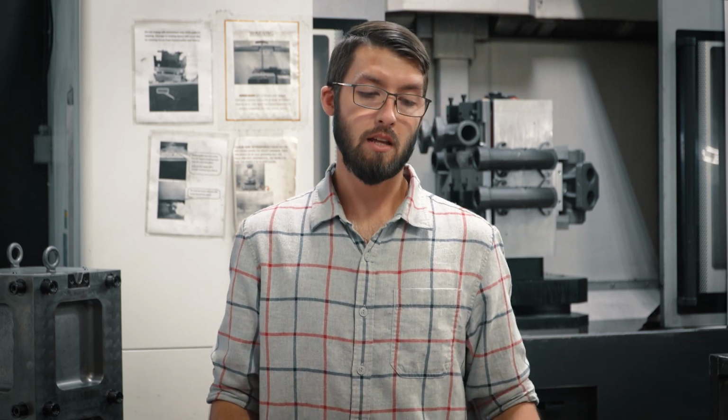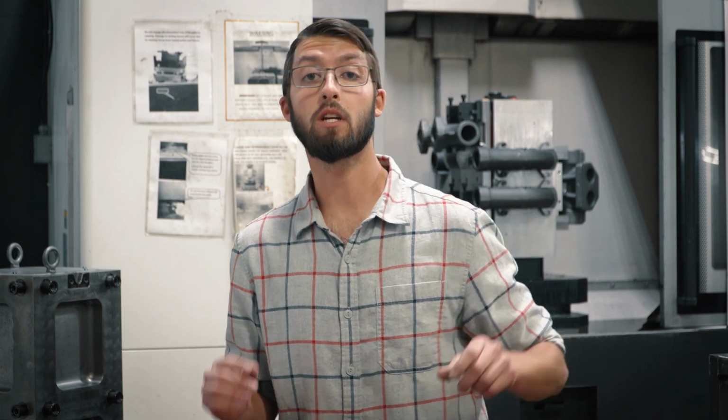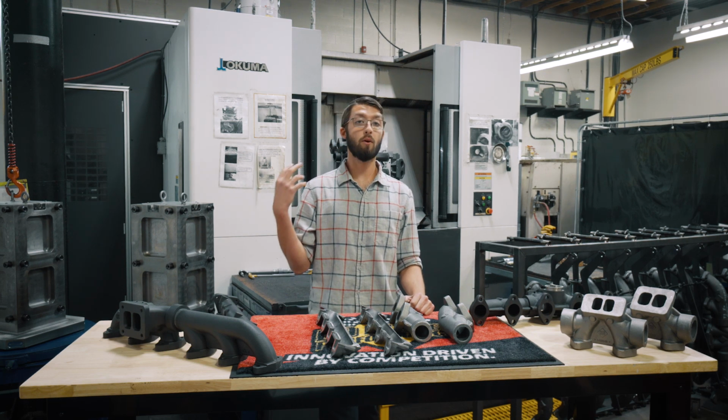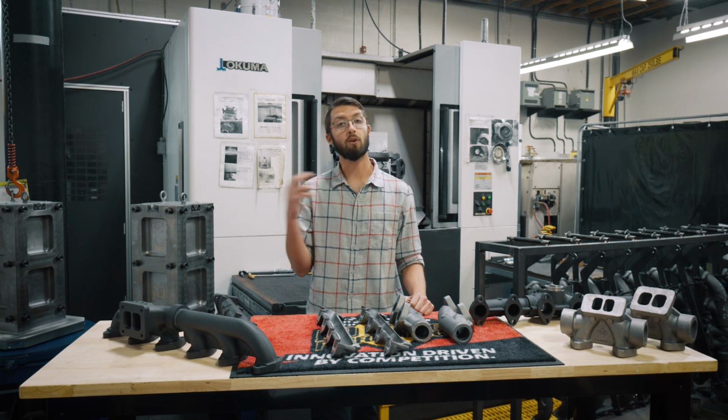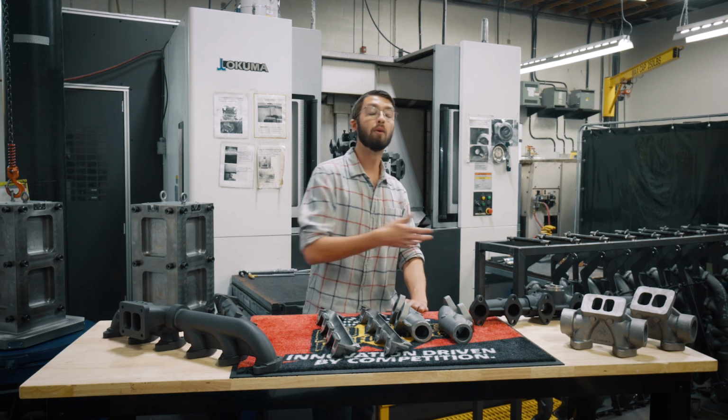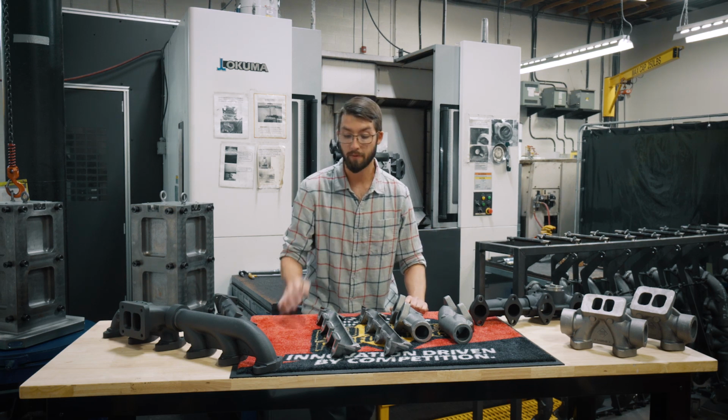So you may have heard of the term pulse manifold. What does this mean? In a 6-cylinder diesel engine, while one exhaust valve is opening, another one is closing, two can be open at the same time. So you might have an exhaust pulse coming out of the cylinder, bouncing around to the manifold, averaging itself out, and then eventually slumbering its way through the turbocharger.